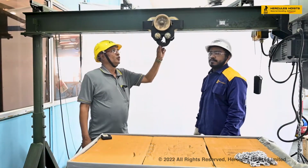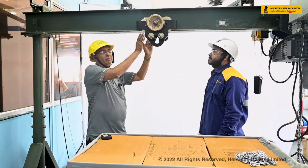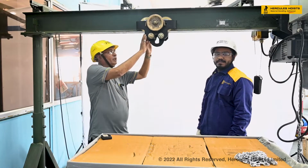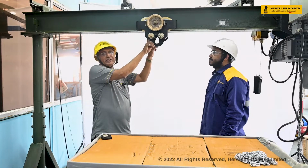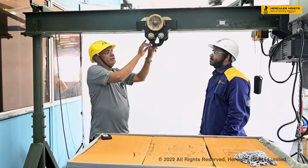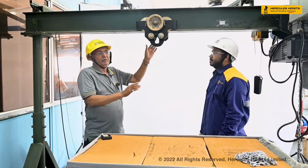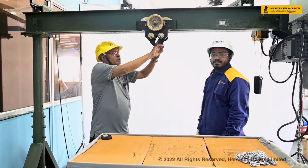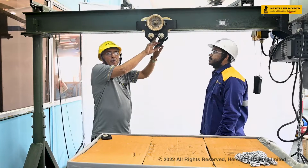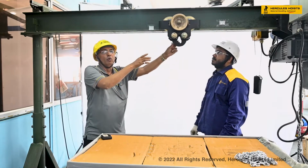This is the 2-ton Indef M trolley. We have mounted it on the I-beam, keeping an equal number of washers inside. We have taken these washers from the extra washers, as we have to keep an equal number of washers on both sides of the load axles. Now our trolley is ready to move.